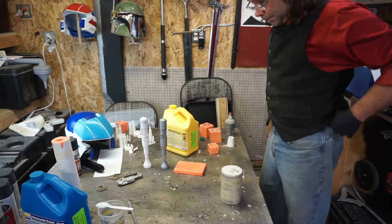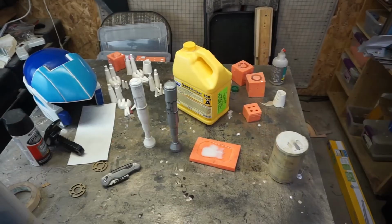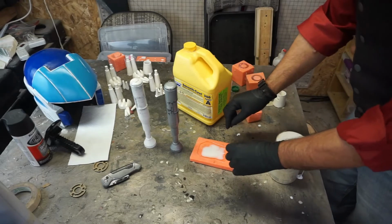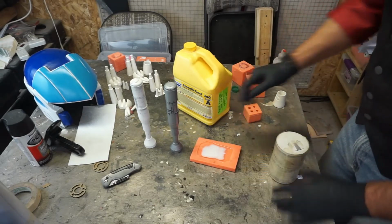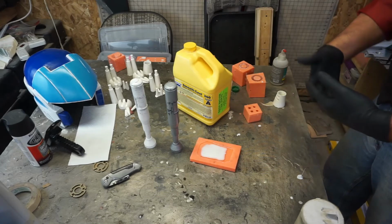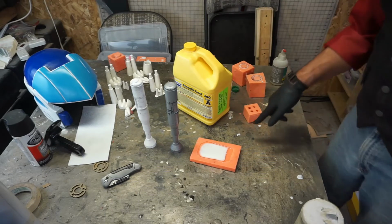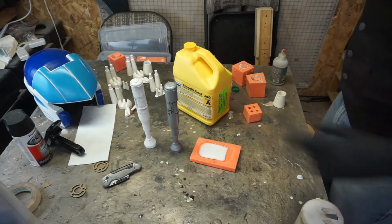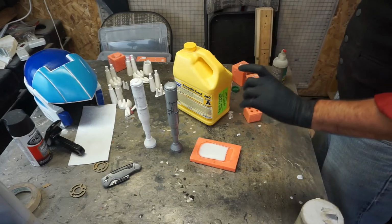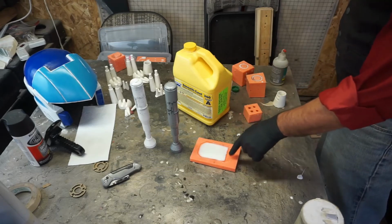So now we wait. This is my favorite part, right? I'm going to bring you in for this. I love watching the spread of white go across this. The 2 polymers bonding together. Because they're all starting to do it. It's kind of neat. The warmer it is, the faster this happens. Also, if you have thick molds, it goes way faster than thin ones. This has thin all around the edges, so this is going to take a little bit.